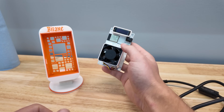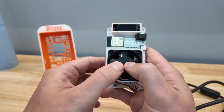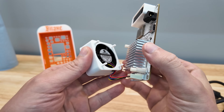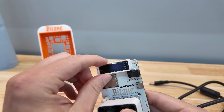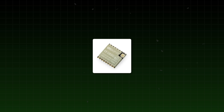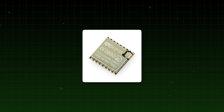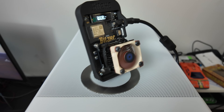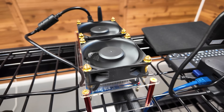What's interesting that ixtech did is you'll look at this fan and there are no screws in it — it's not mounted in a typical manner. This is like a 3D printed piece and it's tight; they just push the fan into it, and it has these feet that push into the heat sink and just keep it firmly situated. It uses an all-in-one Wi-Fi module from Espressif, so it will normally show up on your network labeled Espressif or simply Bitaxe as a default name. Previously we've reviewed Bitaxes distributed by Altair, manufactured by Gecko Science, as well as Power Mining and Tiny Chip Hub, who both make their own Bitaxes in-house.